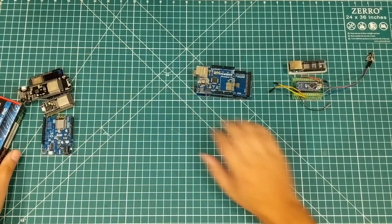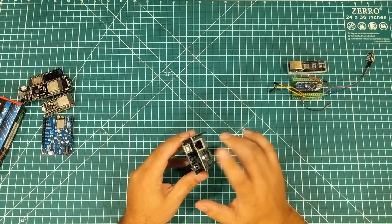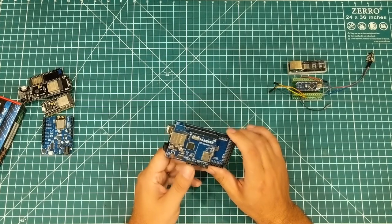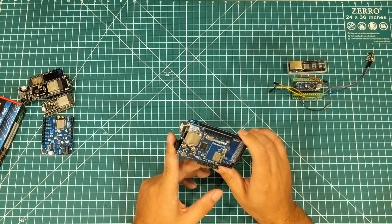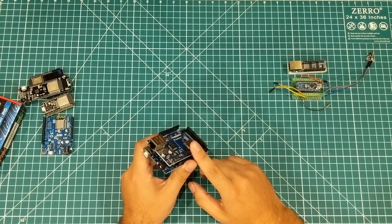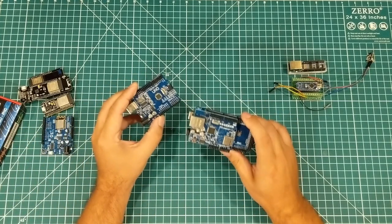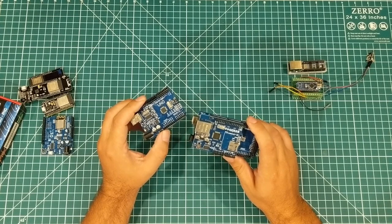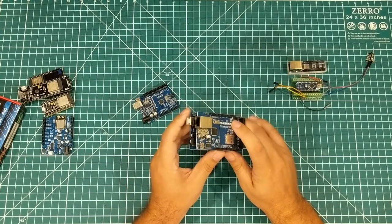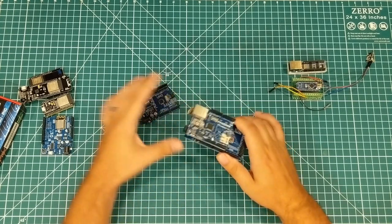But the one thing I think has been missing from the ESP8266 and the ESP32 is Ethernet. If I want to do something that's important, I want it to be wired. Wi-Fi is good, it's getting better, but the 2.4 gigahertz band is crowded. If I absolutely need something to be reliable, I absolutely want to wire it. I've taken an Arduino Mega and popped one of these shields on there — and the reason is the Uno has less RAM than the Mega. By the time you get the PubSub client for MQTT and the basic Ethernet libraries, you're basically out of RAM.